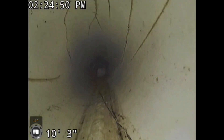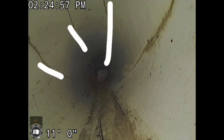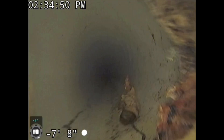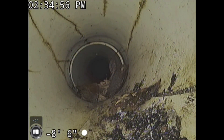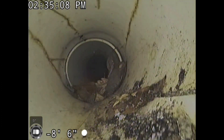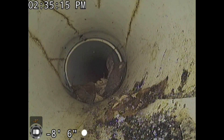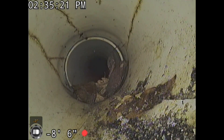Look at that big crack in the bottom of this pipe. Corrugated pipe's flexibility is its strength. You're never going to see this with corrugated pipe. It's going to allow you to run on 1%, 2%, 3%, 4% slope without any issues. The pipe performs really well. If the ground shifts, it doesn't crack. A lot of people think with a downspout on PVC they don't need something to catch the leaves or the shingle gravel. Nothing could be further from the truth — you're going to end up with problems. You're inviting problems by not using a leaf filter or a catch basin.